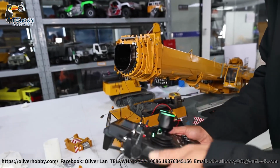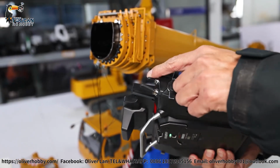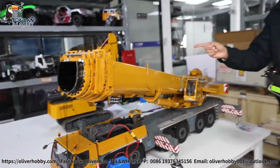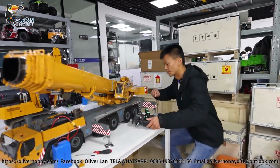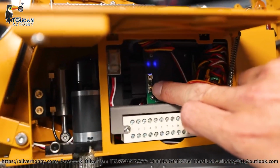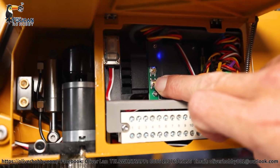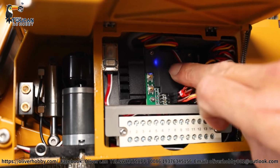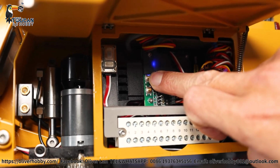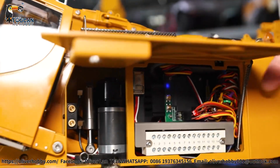Stop the pump, and open the valve another way to release the pressure. Backward, forward, release the pressure, return to middle. That's exactly the number 5 point. Now save it. Okay, first the bottom button, keep pressing more than 5 seconds: 1, 2, 3, 4, 5. Top button, keep pressing more than 3 seconds: 1, 2, 3. Okay, it is saved.